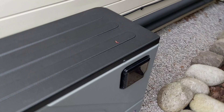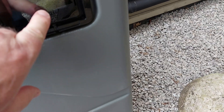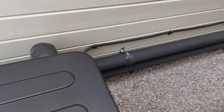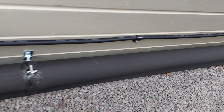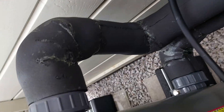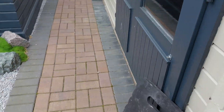The air source heat pump is all up and running and doing very well — it's got the pond up to about 21.5°C now. There are the pipes all lagged with armaflex. There are lots of things that I'm good at, but lagging is not one of them — probably the world's worst lagger. These joints here are just taped up because they're on the inside and don't need to be glued like the outside joints do.